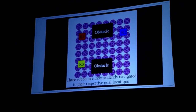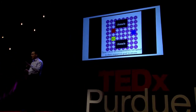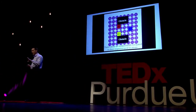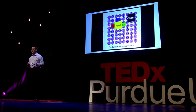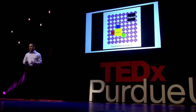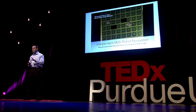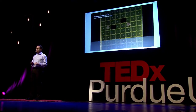We've simulated this idea, and here you can see three robots being controlled by this planar array of microcoils — we're able to get independent control and also use them for collaborative manipulation, travelling in formations to move objects around in the workspace. We've prototyped a system at the millimeter scale where coils are about four millimeters by four millimeters and robots are two millimeters in diameter, and we're actually able to get these robots to move independently using this technique.